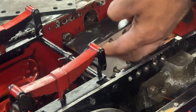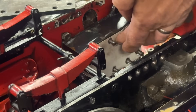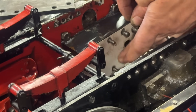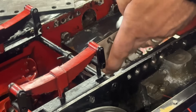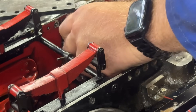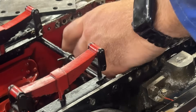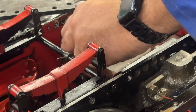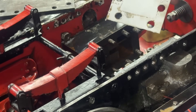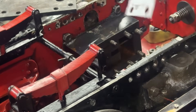We'll just try that in place and it fits. I'm going to rub my finger along the joint — the edge of the inside of the valve chest — and hopefully that will show us where the valve chest is. There you go, it's got a line where the valve chest is, so I'm going to cut that out with a knife and then fit it.